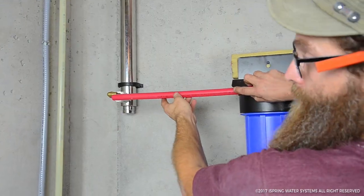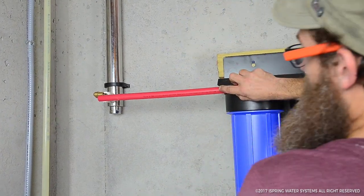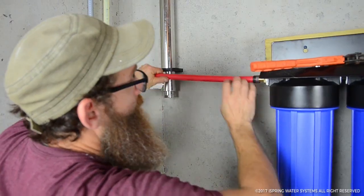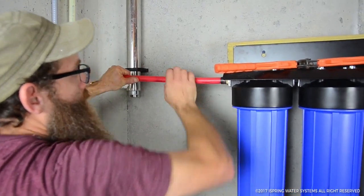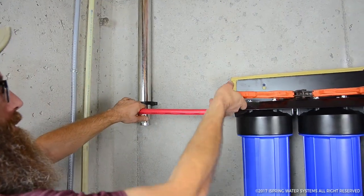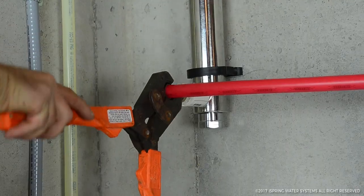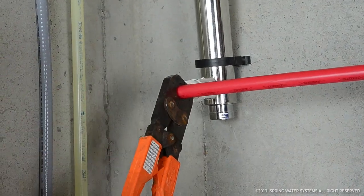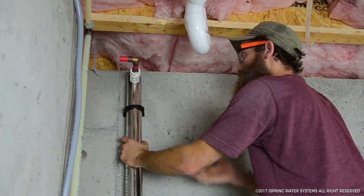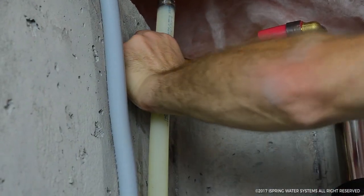I'll snap that one closed when I get up there. For this piece of pipe, the good thing about PEX is it's not exact measurements — I can look and see where I'm at, hold my finger there, and make my cut right there. PEX pipe flexes and is easy to use; other types like copper are not so friendly. Now up at the top, all I have to do is get this locked in, make sure my pipes are lined up, and put my valve and the T in.